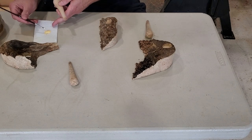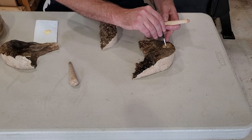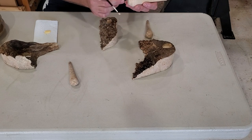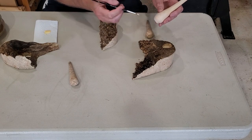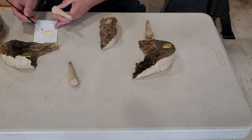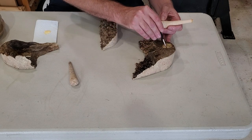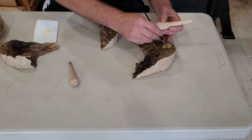And I didn't notice one thing. After you take it off the lathe, you have that center point from the live center. If you take a little drill bit and drill into that before you cut that end off or sand it off, you'll be able to put a little dowel in there, and it'll be a better way to hold it. I had one of them come off and I ended up having to drill a little hole in the base and the stem for it. But just put a little bit of glue in there and it works pretty good.